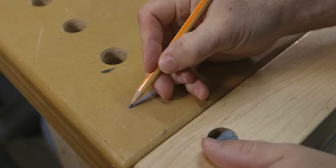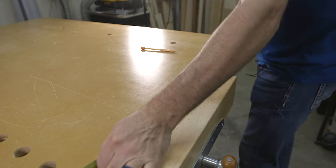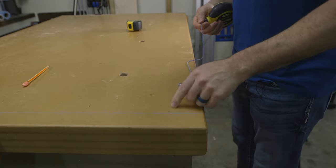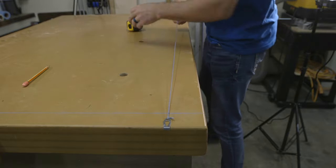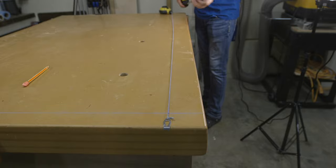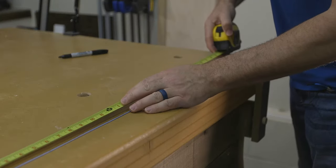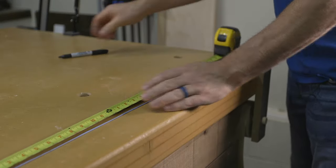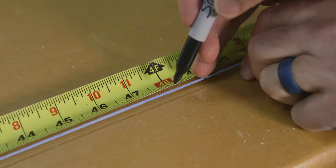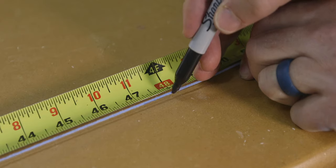We start by making a reference point on this line and then measure over from that point 3 feet and make another mark. With that, take the chalk line now and extend it out, which would be into that hypothetical room, or in our case, up the bench. From there, measure from the starting point up the string 4 feet. Make sure that the string is pulled taut and make a mark. And I've always found it very helpful just to use a Sharpie.